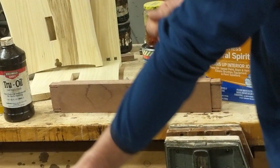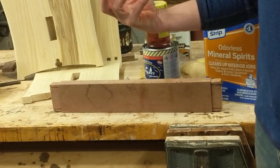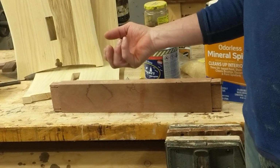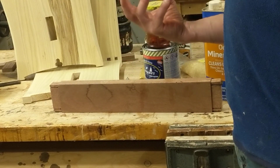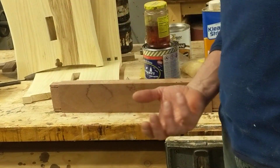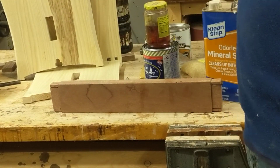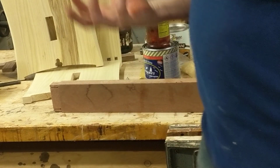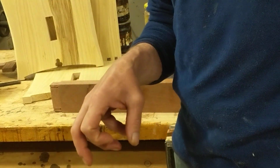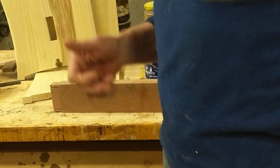As oil-based finish dries, it generates heat. If you've got a rag bundled up, it can and has spontaneously combusted. People have lost their workshops because they had a rag soaked in oil sitting next to some other flammable material. Particularly here in a wood shop, I've got piles of sawdust. Trash cans probably got some scrap wood, scrap veneer, some sawdust in it from when I'm cleaning the floor. If I were to throw that rag in there and it combusted overnight, I'd have a good garbage fire. Could easily burn down the rest of the shop.